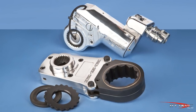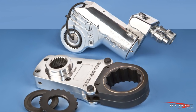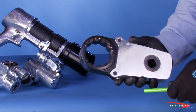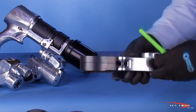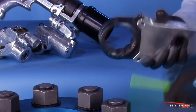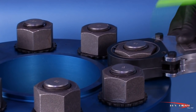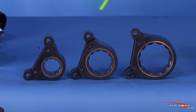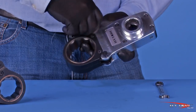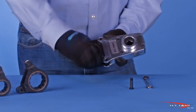A third technique is to use the patented dual drive offset link powered by a high torque Avanti or ICE hydraulic tool. This link allows precision and power to be applied even in the tightest clearance areas, once again without any external reaction or pinch points. The outer hexagonal piece reacts against the new high torque washer while the inner socket tightens the nut. To combine one of these hydraulic wrenches with the offset link, begin by choosing the correct size ratcheting socket for the nut to be tightened and for the size of the square drive in the hydraulic wrench.